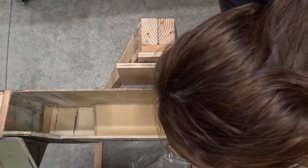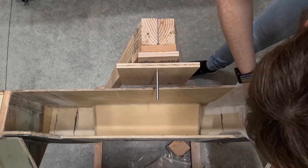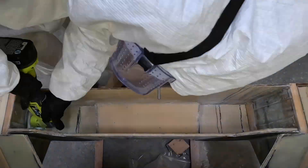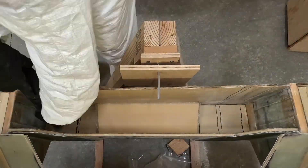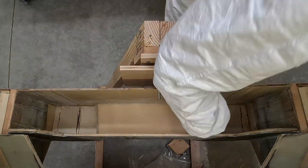Then you can see me making three more templates for the three different shapes I'll be installing here. And then yet more sanding. This is with mostly 36 grit sandpaper, though the sandpaper discs I'm hand sanding with are at 50 grit. At this rough of a grit, I'm more roughing up the surface than I am smoothing it out. This is what aids in creating a mechanical bond for the reinforcement layers to grip onto.